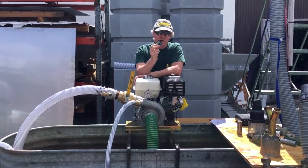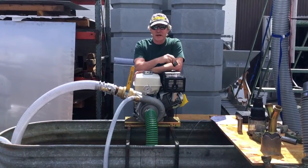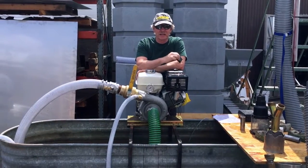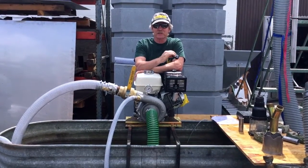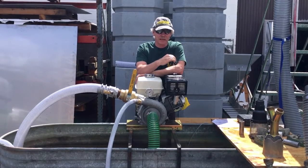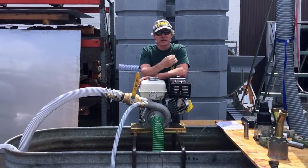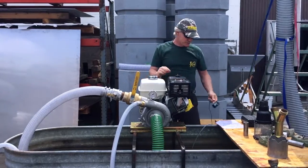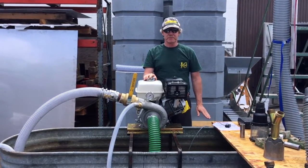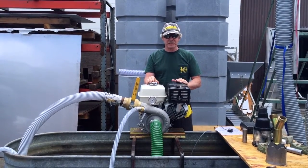Also when we're testing, we always run an RPM gauge on the motor. This allows us to make sure the engine comes up to full speed and has some governor left over for altitude. A lot of people will just load the engine as heavy as they can to get max performance, but if you get into any kind of altitude it kills the motor, overheats it, and shortens engine life. We're very conscious of matching the pump to the engine horsepower — if you put too big a pump on an engine, you'll overheat it and won't reach proper RPM. So we make sure we get up to at least 3,600 RPM, and once everything is working under load, we grab the governor and pull several hundred additional RPMs out to confirm we have room for higher altitude operations.